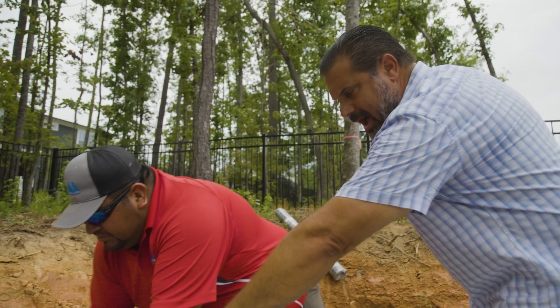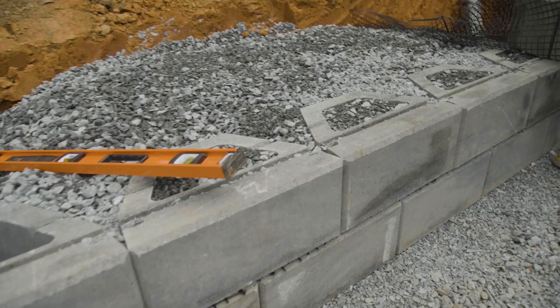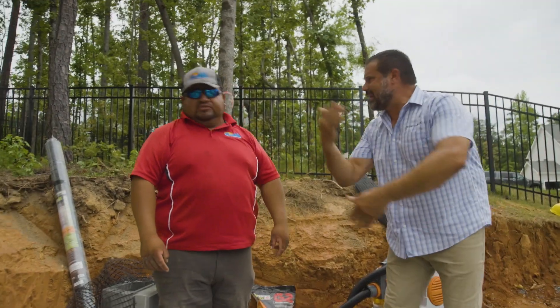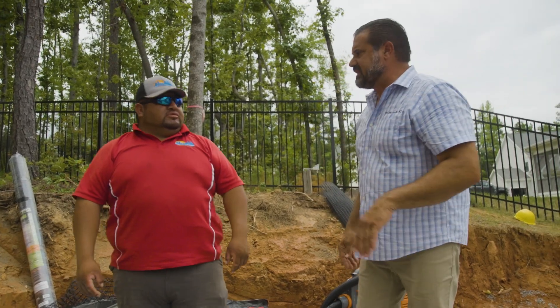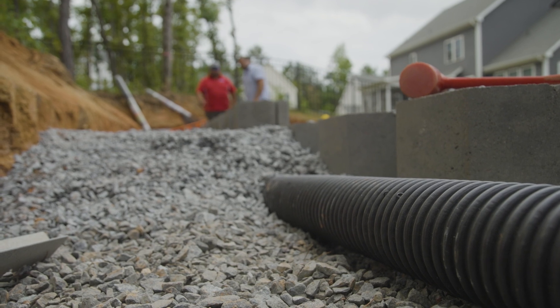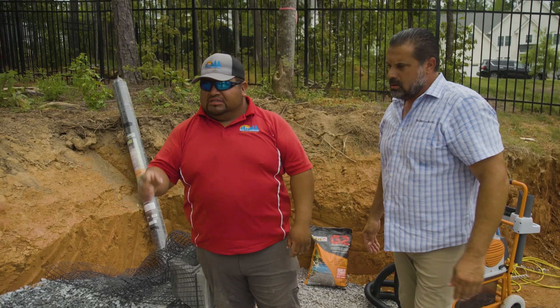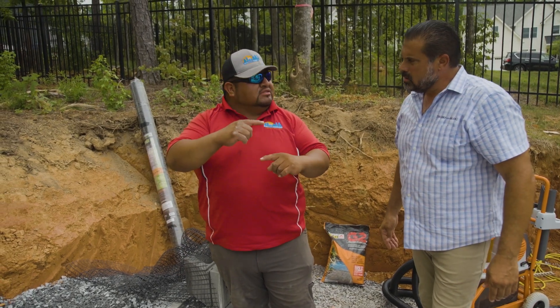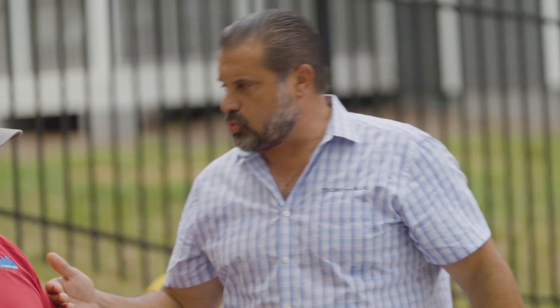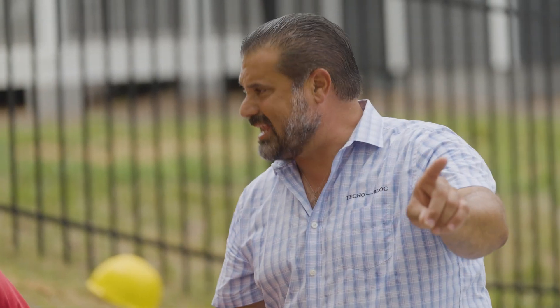I do see that there's some gravel on the block — how do we make sure it's clean? We use the vacuum — a HEPA particle vacuum. So we're not using a broom or the back of our hands. Now I see the drain tile for behind the wall down there. The pipe is still two inches on the base and two inches high, so it's actually embedded in the base. That's one of the benefits of using clean stone as a base — we can get it very low in the horizon, catch that water, and it's daylighted.